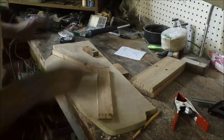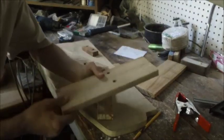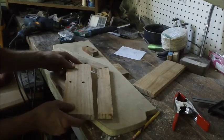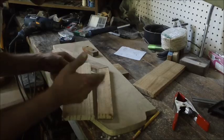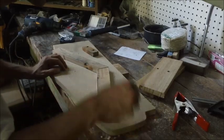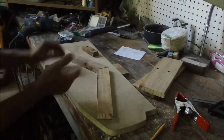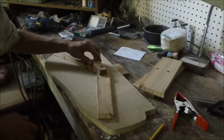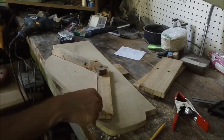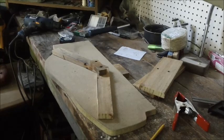Alright, I got a little ahead of myself and forgot the video was off. What I did was I took one of those pallet boards and cut it into ten-and-a-half-inch sections, then cut it in half lengthwise — I didn't want something that thick up there as the roof brace. I eyeballed it and penciled in the angles I wanted, jigsawed them — not perfect, but it's going to work. I'm going to set them in here, brace them together, hold it up to the house, mark out the curves needed to sit on the wall on each end, and go from there.